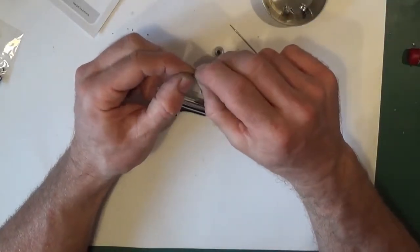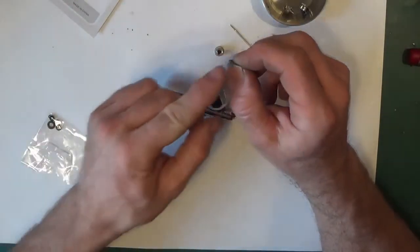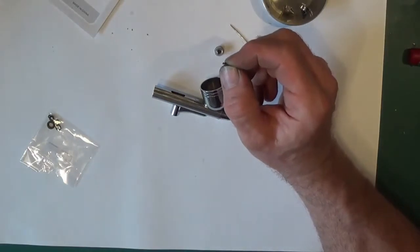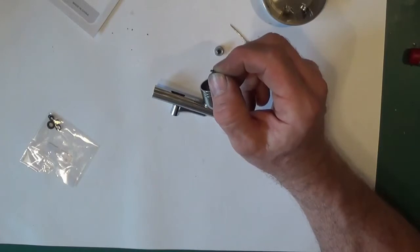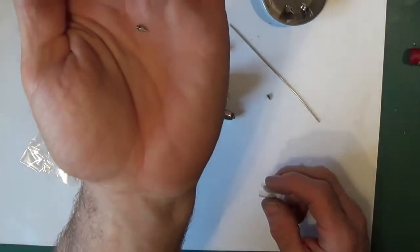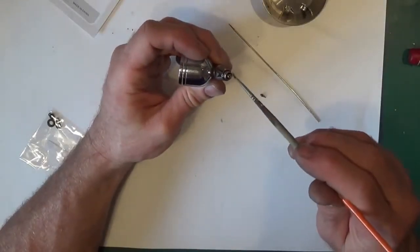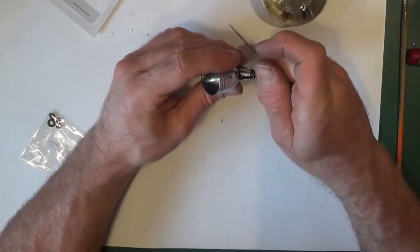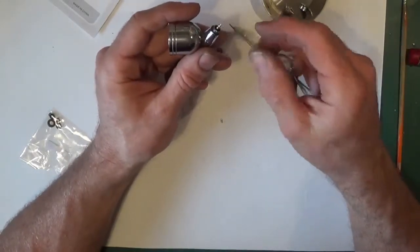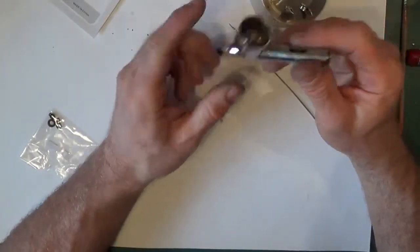Now when you replace the nozzles, they actually do come with seals, and I have in one set somewhere, it's not this one, I have seen that seal. I'm not even going to attempt to change that one. It can be done. Let's have a look. No, it's not in these packs, but when you buy the nozzles, they always come with a new seal anyway, so I've never known one go. At least then the seal isn't going onto dry metal, it's stretching, and just tighten that up. Just finger tight, really, really finger tight. You don't need anything else. So that's that seal, the front seal. We've got the nozzle back on.